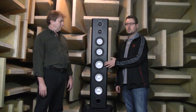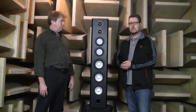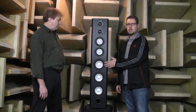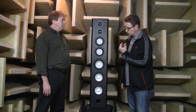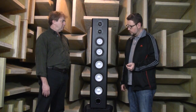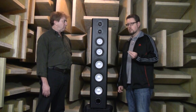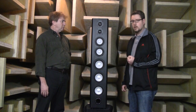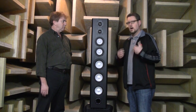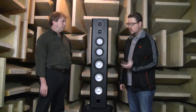There were two major things we had to address. One was the woofer — which by the way is also available in high-power versions of both the M60 and the M80. This new woofer has a larger voice coil and a larger roll surround, which means there's more linear excursion capability and it can handle far more amplifier power than the existing M80 woofer. That's not to say the M80 is any slouch, but if you're going to be running high levels right down to 30 Hz or 25 Hz, you need that power handling capability.